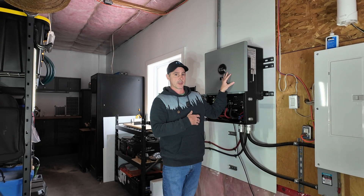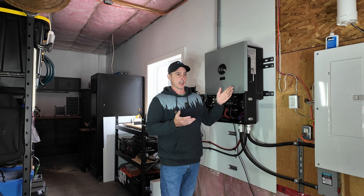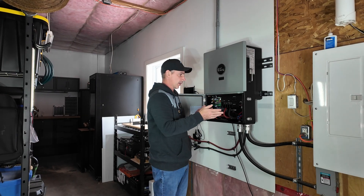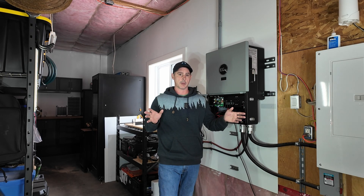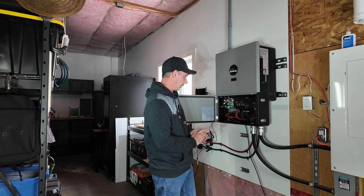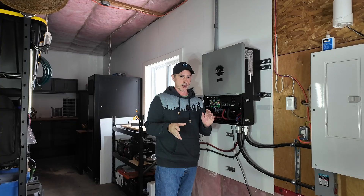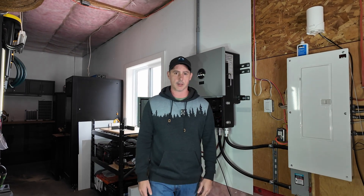Because there's no big transfer switch inside this unit, that's why they're able to sell it for a great price. There's a delay of probably a couple minutes for this to switch over to grid mode, because I do use it to back-feed my house to save money on electricity - but that's another video. I use UPSes on all of my internet nodes so my internet stays up and running even though the power is down, and that way if I need to make any adjustments I can go into settings. I'm going to turn off the battery, hit my disconnect, and turn off all my server rack batteries because they're all from different companies - I have them wired as a lead acid battery.